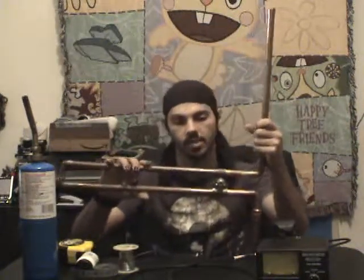Another cool thing about this antenna, which I'll get another close-up of in a moment, is the actual feed point. The feed point, in which the RF or coax attaches, you can design so it's adjustable. Being that it can be adjusted down the stub end of this antenna, you can change the resonant frequency, always good in the field, and you can change the SWR. In a little while I'll show you how to tune this antenna using an SWR meter, making this an extremely versatile antenna that can be used on practically anything, 2 meter and 440.